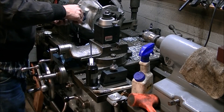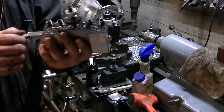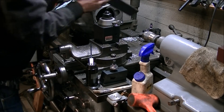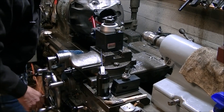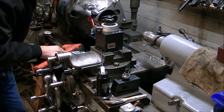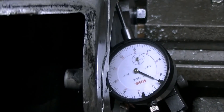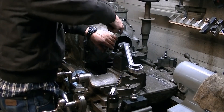The internal contours meant it cut through almost everywhere except that one little spot, then the part shifted and bound up — you can see where it broke off. The tool actually shifted in the tool holder, not a lot, but it's shifted a little bit and not sitting flush. So it's time to clean up and see if we can salvage this part. After a minute I got it in far enough with a little bearing on the part, and you can see it's running within a few thousandths. The big jumps are gouges that were left when the tool bound and gouged into the side of the part as it shifted.